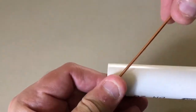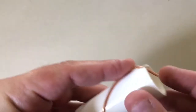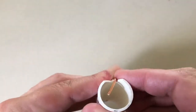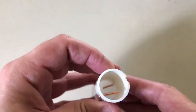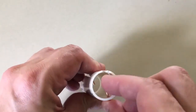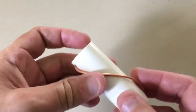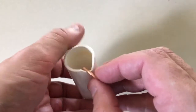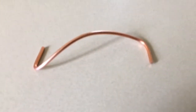For the off-camera part where my hands block your view, I'm basically following the bend around the former with my thumb. I haven't cut this lobe to any particular size — remember, it's a re-enactment. The straight ends of the wire should be 180 degrees apart looking down the centre of the tube, so now's the time to fiddle with it. Not quite perfect; I would have had another go at that for the real thing.